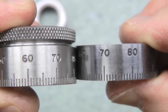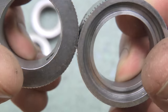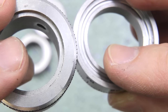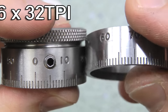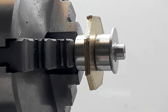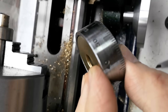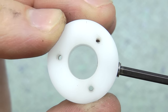The figures will be upside down in use, but I can cope with that. To reduce the bulk I removed the knurl section and added grooves on each edge to take O-rings that would provide friction drag when the outer is rotated. The 2BA threaded hole wasn't any use to me so I silver soldered it up and dressed it back. Using a fairly sketchy arbor I turned up a couple of brass end cap washers and made a centre core from Delrin that I can lock to the shaft with a grub screw.